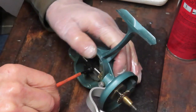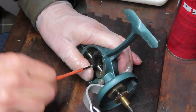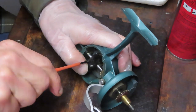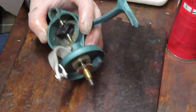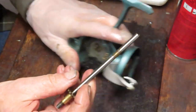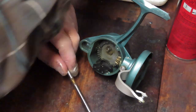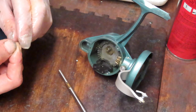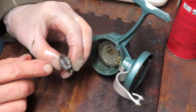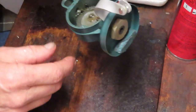I don't imagine you can run down to your local nuts and bolts supplier and grab a replacement crosswind block for this. What's going to separate is the axle — it's going to come out, not the case. So there we go — we pulled the axle out. Those two screws went right into the axle shaft. We'll just put that to the side for a moment. Big block — not hard to figure out. It is a crosswind block; it rides on a stud. We're good with that.